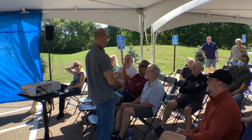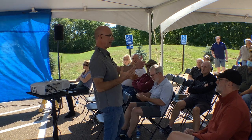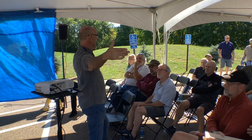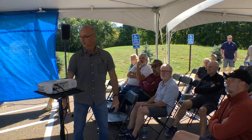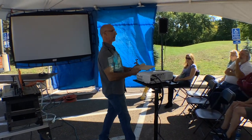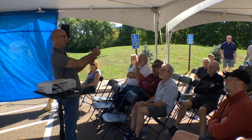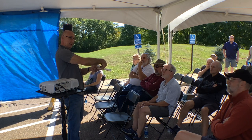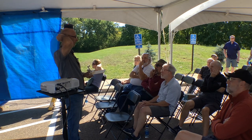If you absolutely need to do a long grain cut before you do an end grain cut, honestly, in a commercial cabinet shop, what they do is they do the long grain cut in 8-foot sticks. And then they cut them to length and they cope the end. All you need to do to make that work is this sled. This sled needs the profile cut here so that the coped piece fits into that profile. And then you can do that supported so you don't get the chip. And that's how they do it on a commercial basis where they're making billions of them.